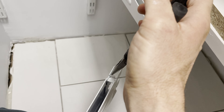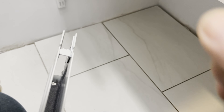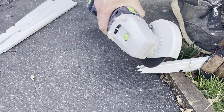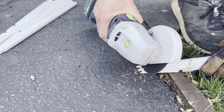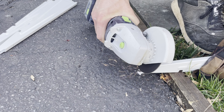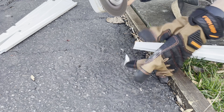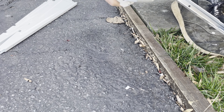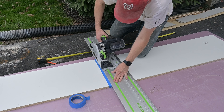As mentioned, these brackets were actually designed for wire shelving, but I'm using melamine instead. There was a little tab that hooks into the wire rod, so on each one of them I just had to break it off. It wasn't too bad because that thing actually sticks above the surface. On the end, because it's a wire bracket, it also has a little loop that hooks onto the wire rod, so I just cut those off with the angle grinder as well — they just looked a little strange. A little bit more work, but nothing too bad. Then just round it off, deburring, making sure nothing could cut or scratch anyone. Then went back and painted it.